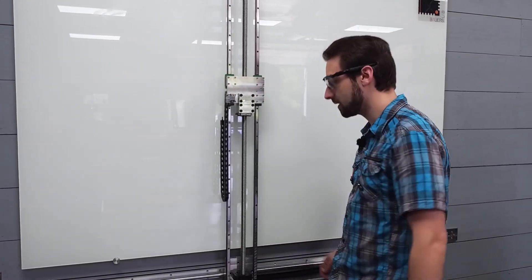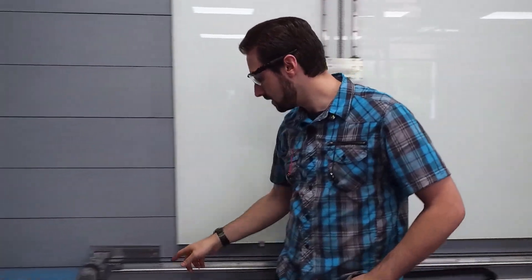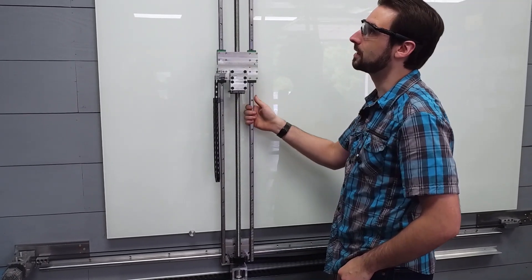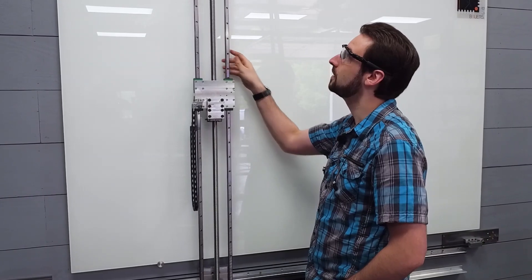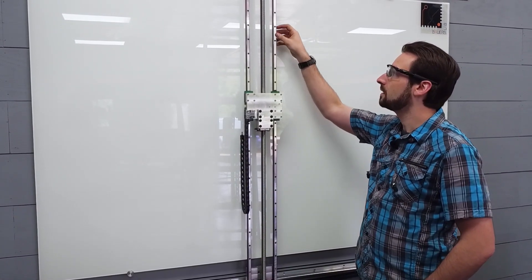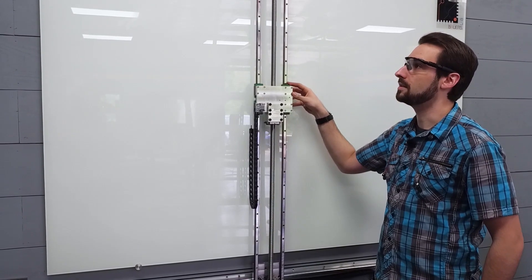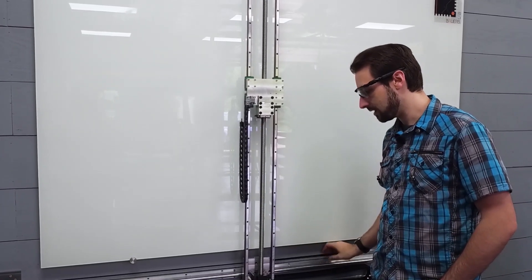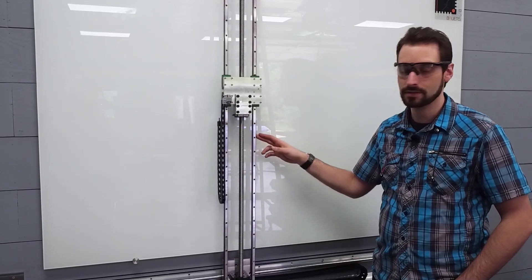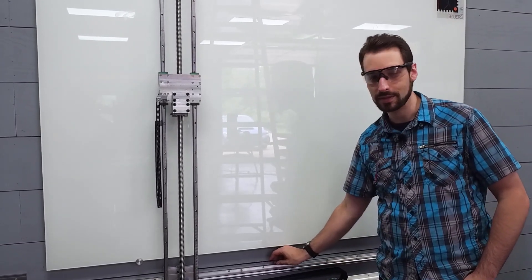I think that's everything that I can put on now. It works pretty well, but there's a little bit of finagling to do. The belts — these were meant to be just the right size that the belt would go on either side, but they're interfering a little bit, which is causing some friction. So I'm probably going to go in and shave off some thickness on those. But other than that, this is working really well. These two belts go across and keep the top and the bottom synchronized, because the linear rails aren't very good structural elements and the whole thing can kind of flop around. I'm kind of surprised how well the belts work for going this far — I was testing whether you can get 10mm width belts to go that far reasonably, and it seems to be working.